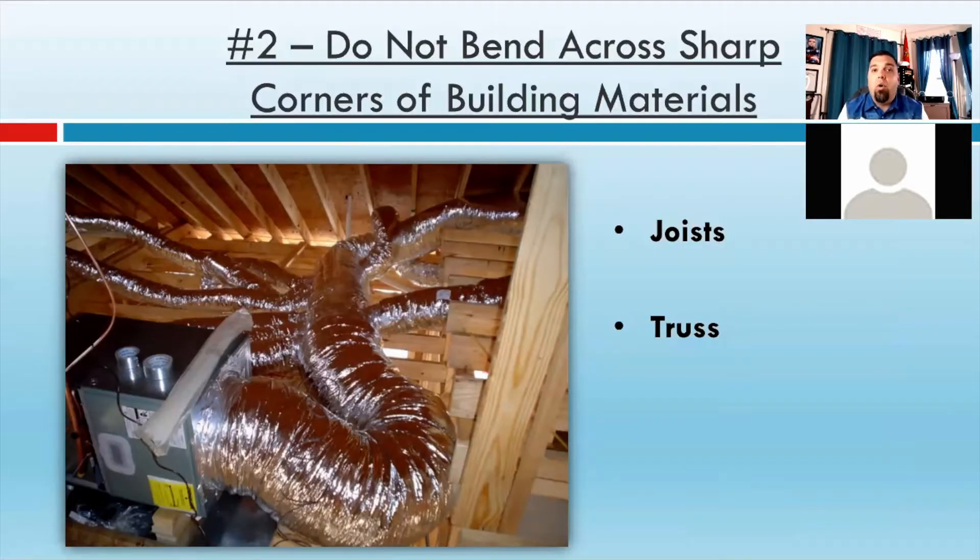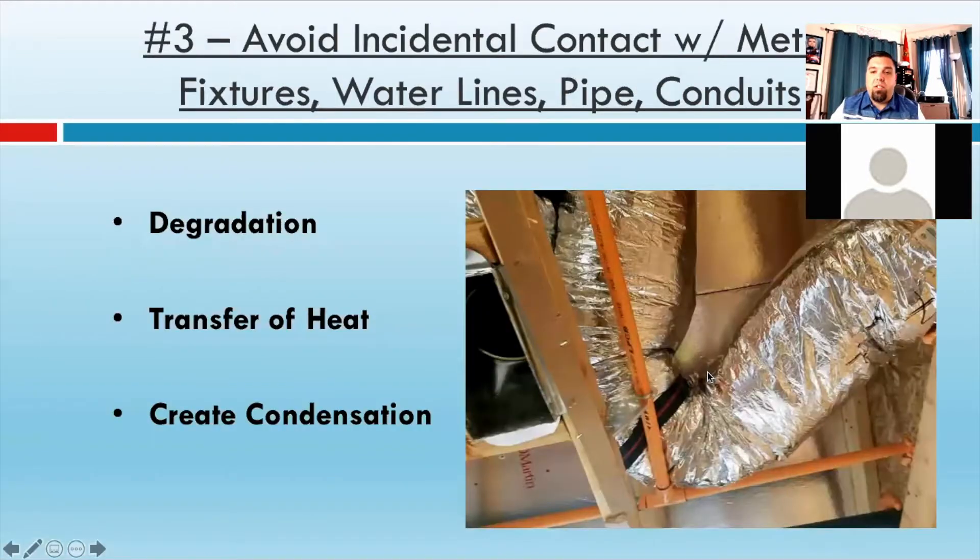It doesn't meet the IMC. If you're working in states like Massachusetts, the sheet metal code uses the International Mechanical Code — the most recent being 2015, and they're moving on to the 2018 soon. Most of the country is at least on the 2012 IMC, and that spells out duct work installation, including minimums like hanging. Unfortunately, it doesn't specify flexible duct specifically, and they still reference the ADC's resource. So, no use of joists or trusses to hang your duct work.